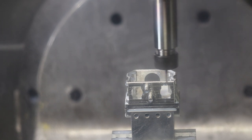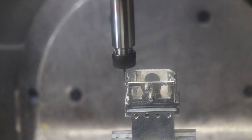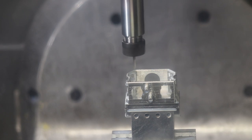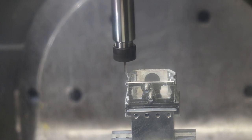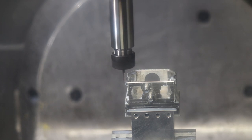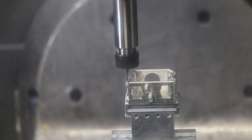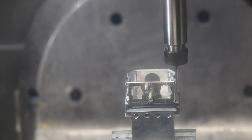And here it's actually interpolating the tetrahedrons in the 3D model itself that was imported. So 3D models are basically a bunch of triangles that make up a 3D part, as well as surfaces and or curves that are truncated into line segments. So it's actually machining a bunch of little micro triangles that are artifacts of the 3D model. That's what that hopping is. It's drawing one little triangular facet, hopping up out of the part, dropping in for the next little triangular facet. It's really just artifacts from the code, from the CAD model itself.